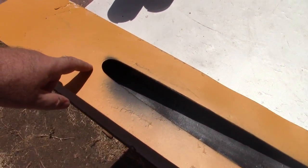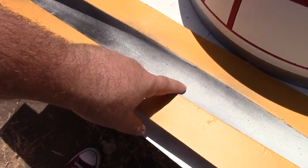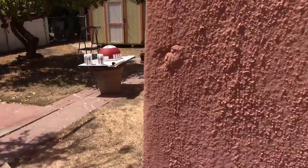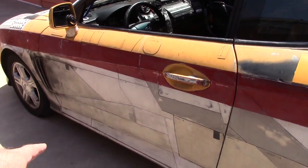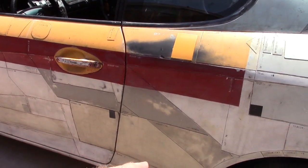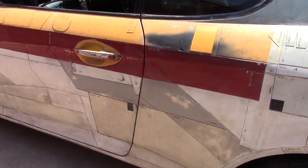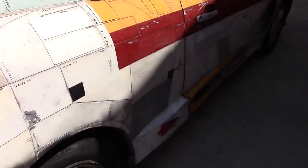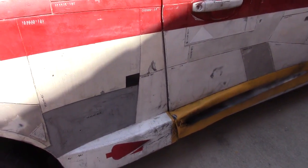The trick is going to be drilling a hole through here and over here and then putting a flush bolt onto that to keep it going. And so, like I said, there will be 2 bolts. Drill a hole through the sides there along the crease. Stick it on, then form it into place. There will be a back spot here, basically a half tube, half lengthwise that is. And that'll get on there and again form it into place to essentially match this side over here. It'll be a little work, but it's not too bad at all.